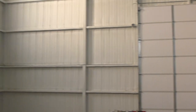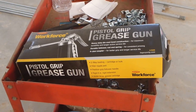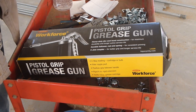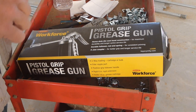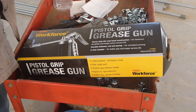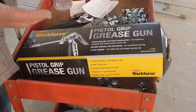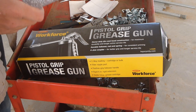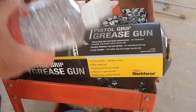I tried lube, but lube wasn't working well. Here's what I'm going to do to make this easier since I don't have someone to lube the wires for me and I don't want to push lubricated wires up into the conduit. I'll come along and give it a little nudge, dressing the wires coming off the spools to make sure they're flowing and feeding in smoothly without damaging the insulation or the jacket — the protective layer. It's got a nylon outer coating; this is THHN. I don't want greasy, slick wires. Also, I don't want to run back to where I'm doing the pull with greasy, slick hands.